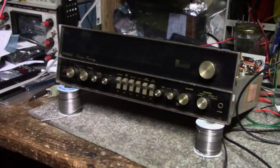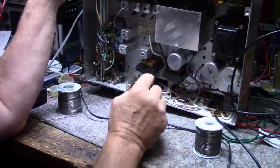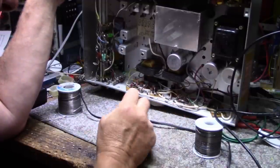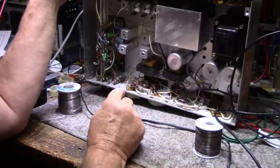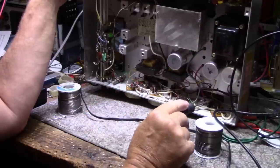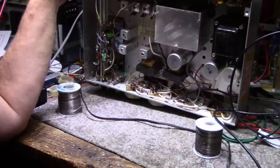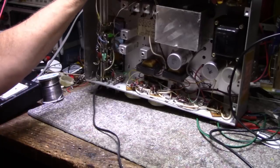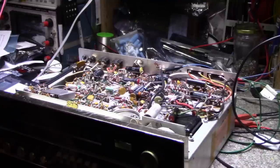That was not cool — lots of sparks and flames. I got a good whiff of that. So we got two more blown resistors on this channel, which means both channels are out now. Do the germanium transistors just die from age? This channel blew while plugged in — I obviously didn't remove the transistor from this one. Now this one is gone too. That's interesting.